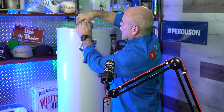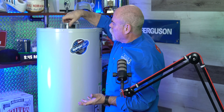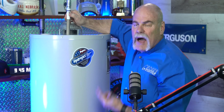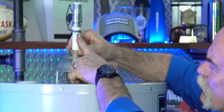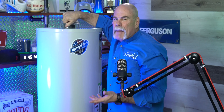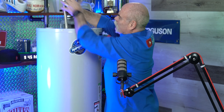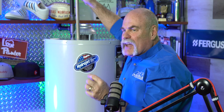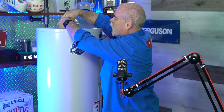On the inside, you've also got your anode rod. On this water heater, it's actually attached to the hot side — when you pull out the dielectric nipple, the anode rod is attached to it. To replace the anode rod on this model, you loosen it up. The anode rod is a sacrificial rod that, over the course of its life, gives itself up and is drawn to the outer part of the tank to plug up any cracks, micro fissures, or pinholes that could occur. Replacing it should be done around the end of the first year.